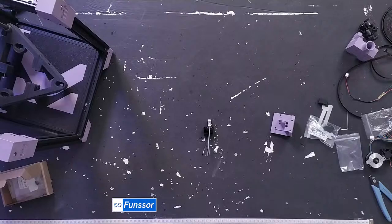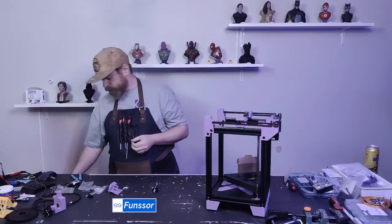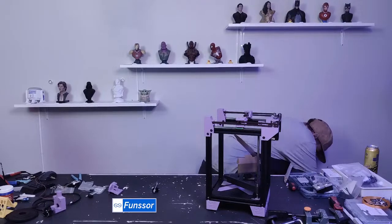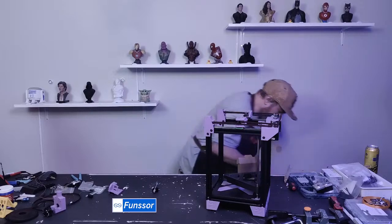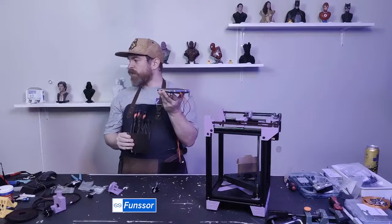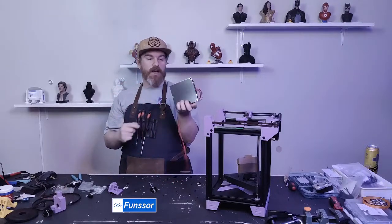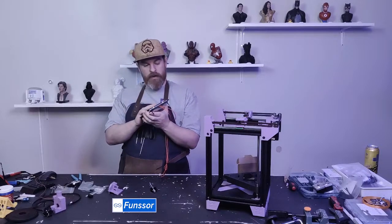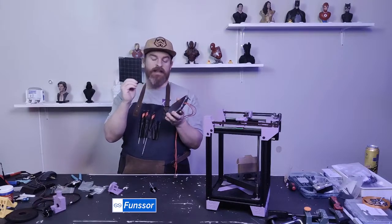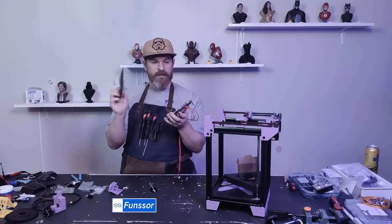Glass bed. This is not. That's done. Perfect. This is not going to have a glass bed. I'm using a Voron V0 bed. That's what this has been designed for. So I'm using this bed, a Voron V0 bed from AliExpress. This is the cheapest one that I could find with the cheapest 60 watt heater, and it's perfect. It's been printing for a long time, and the only thing that I didn't buy that was the cheapest was this thing. This is the FYSETC. I call it Feistech. It's their PEI sheet with a carbon fiber side, and that's real carbon fiber. It's not just a sticker.